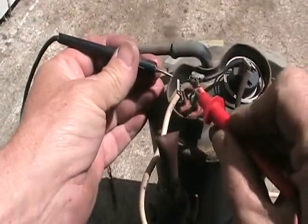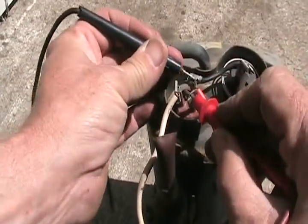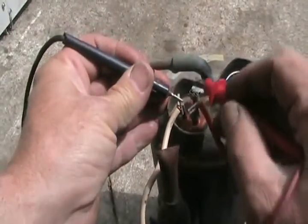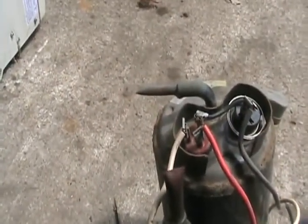Next, go across any pair of terminals until you have tried them all to see what reading you get on your meter. Each way you try them, you should get a low ohms reading. If you find two pins — or all the pins — have no reading on your meter when you're continuity testing them, then you also have a bad compressor: an open circuit compressor. This method doesn't tell you 100% whether your compressor is good or bad, but it helps diagnose electrical problems. The compressor can be seized up, have partially shorted windings, be overdrawing, or have all kinds of different problems, but at least now you've diagnosed why it seems to be dead.